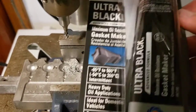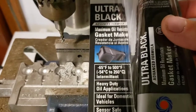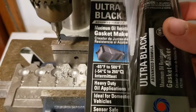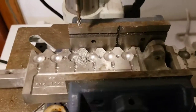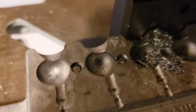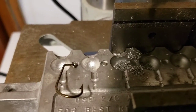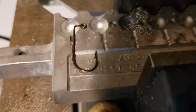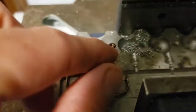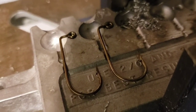Put a little bit of ultra black. You can use high temp silicone — that's orange or whatever color. I just went with the black because it's good up to 500 degrees. Lead melts at 600 degrees, but the mold itself usually is 200 degrees at most, so using something that's good for 500 degrees is fine. I got a couple of them in there already. You pretty much just get them anywhere near, and they drop right in place. The hooks stay put. I showed in another video on Facebook, and I shared it on Fishbrain also — I was holding this upside down. These magnets are 1.4 pounds of pulling power.